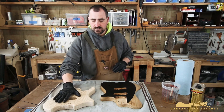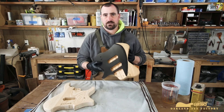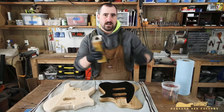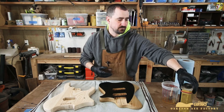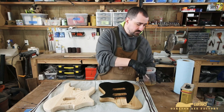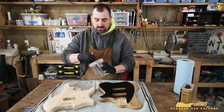We're going to be doing the initial soak-down on this one, and we're going to keep this one going — they're getting the same exact finish type. What we're using today is Minwax wipe-on poly. It's one of the most high-quality wipe-on oil-based finishes that I've used, and what I like a lot about it is it's very, very thin compared to something like true oil.